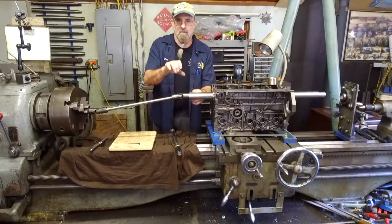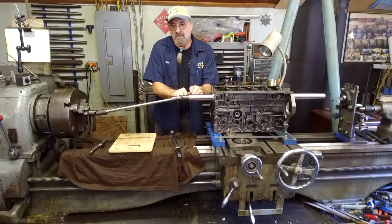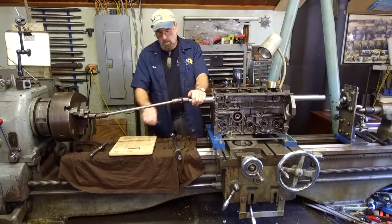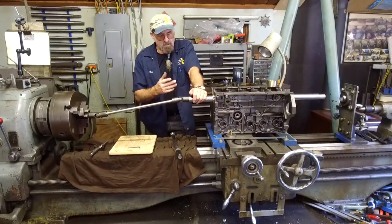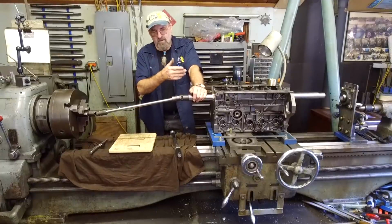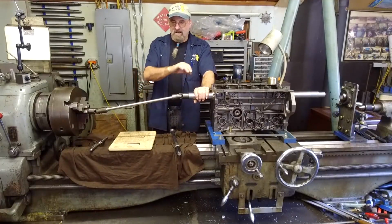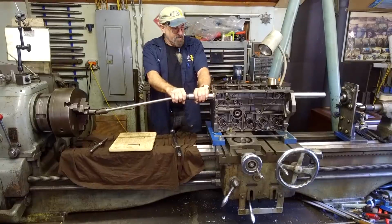When you've got flats, I like to rock it just slightly, making sure you get in the center of that flat. And the reason why you put flats on there is so that the set screw, when it comes down, mushrooms the surface. You want a good mushroom on the cut point, because that's where it's seating, and you just don't want that metal to come up and raise up into a bore. If you had a straight bore, no relief, then that raised material would drag out of the bore. As long as the raised material is on the flat, which is never up against the surface, you have no problem taking the thing apart. All right.